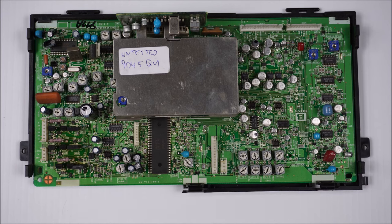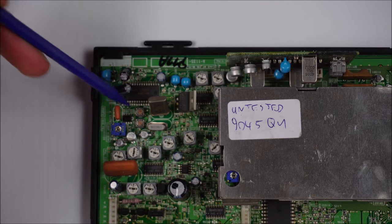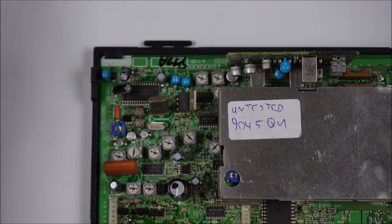On a side note, you may be interested to know about what Sony did with the next generation of monitors. They still used a very, very similar architecture to the previous generation, which is featured in this video. They did, however, change the circuit that's in question that's problematic. Going closer in, instead of through-hole trimmer capacitors, Sony opted for surface mount trimmer resistors, both in a very similar position. There's one and there's two. I don't think they had any troubles thereafter once they made this change.